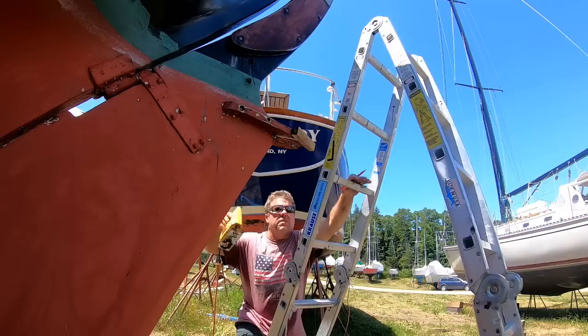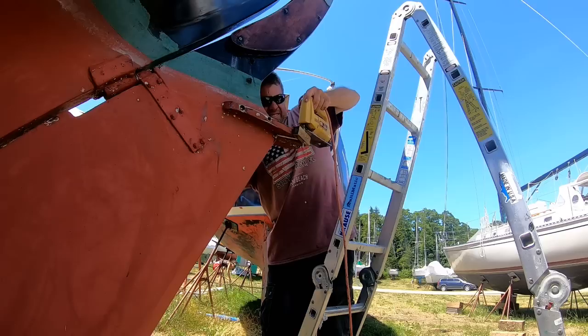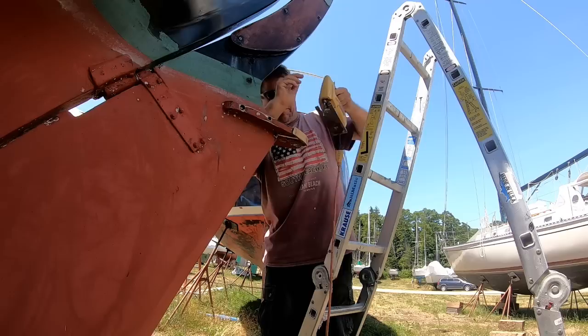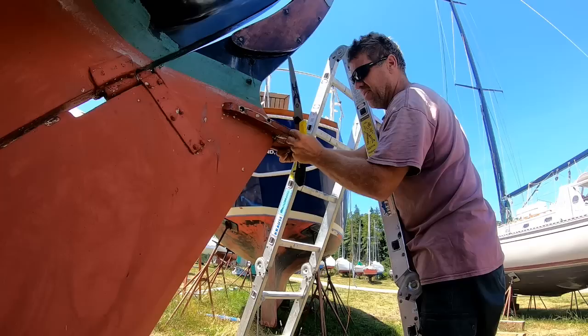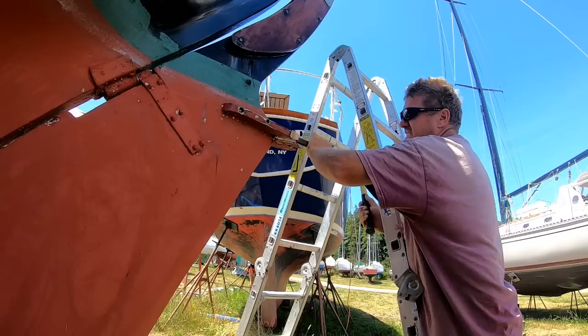The epoxy is now cured, so I go about trimming off the excess on the scarf. I'll start off with a saw, then use a hand saw just to cut vertical depth slots. These will help me to chisel off the remaining bit of wastage — the little bits of wood just come right off when I whack it with the chisel.